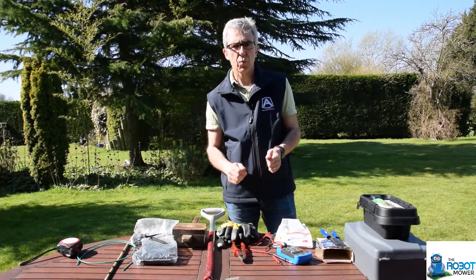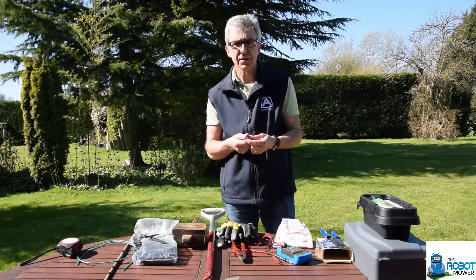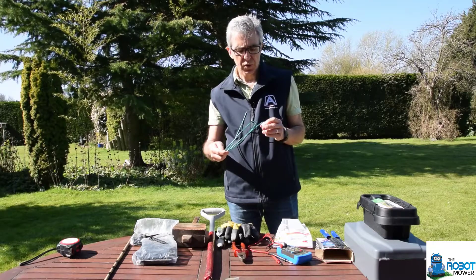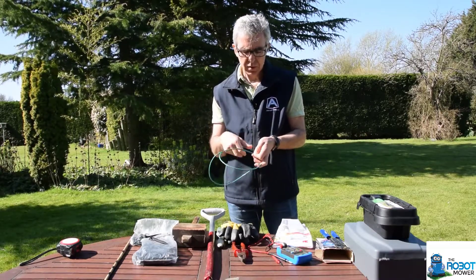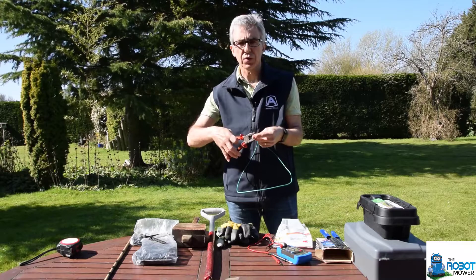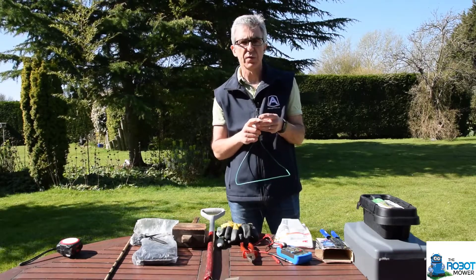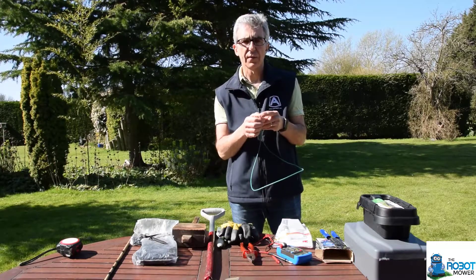If you find that you haven't got one piece of wire that will do the whole length and you need to join two pieces of wire together, then use a decent joint. We use these — they are gel-filled joints which are specifically made for this type of wire. You take both ends of the wire you want to join and slide them into the joint, making sure that they go all the way in. Then close the joint with a pair of pliers. Make sure that the joint closes fully — you may need to have a couple of goes on both ends of the joint. So long as you can get those completely closed, the gel in there will keep the water out and you should get a good connection. You don't need to remove the insulation from the wires beforehand — this joint actually cuts into the insulation and into the core of the wire to make sure it's got a good connection.